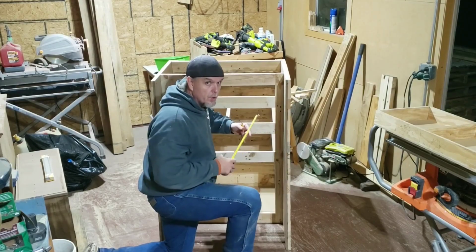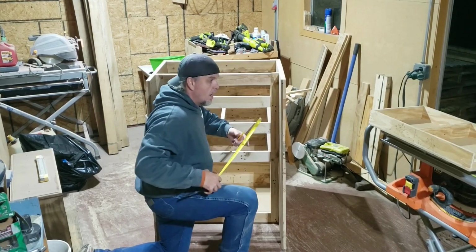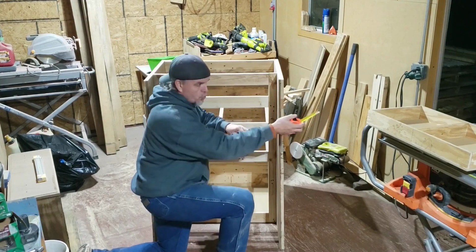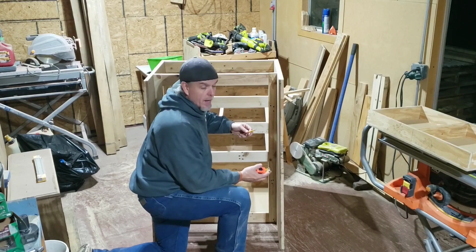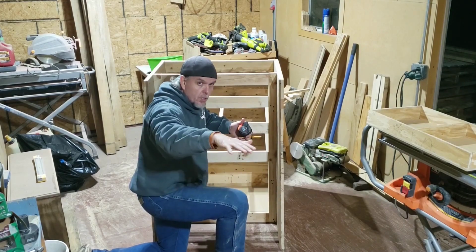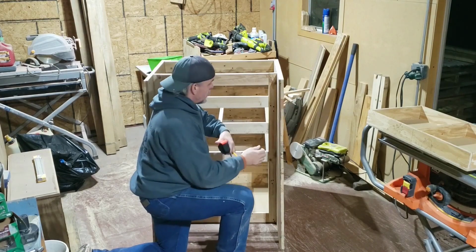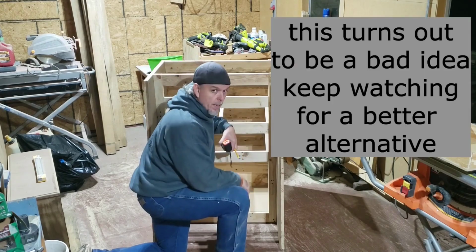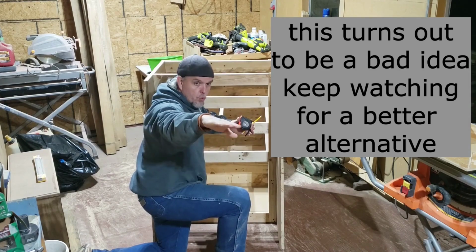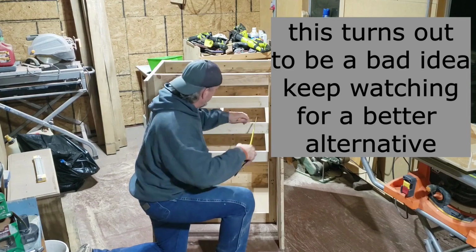Hey, I'm glad you're still watching. Today, I'm going to measure out some sideboards for the drawer. The drawers are just going to be on wooden runners, obviously. We're not going to put any fancy rollers in there or nothing. And if the drawer gets a little crooked, it jams in that hole. So I'm going to cut some of this hardboard I got, and I'm going to glue vertical sidebars on it so the drawer can't wobble back and forth. So let's go measure those out. I'll show what I'm talking about.